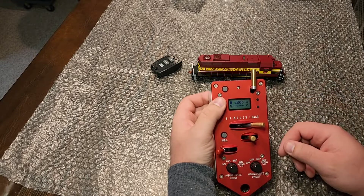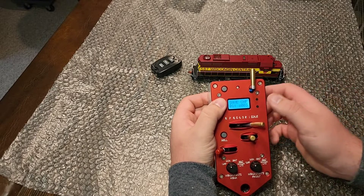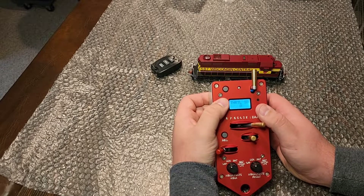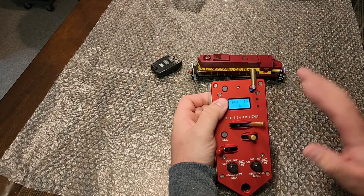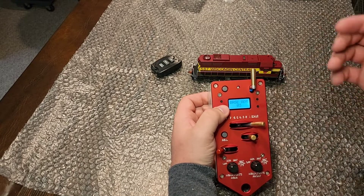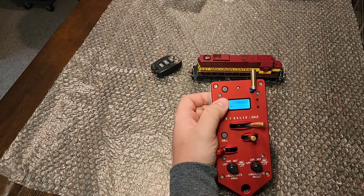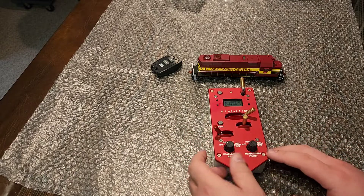So it's probably not set up to go to my receiver, which is fine. We'll just go through to the command configuration. We need to set this to number five — basically E — because this is my fifth throttle. Base address is three. Save that. And we're good to go.